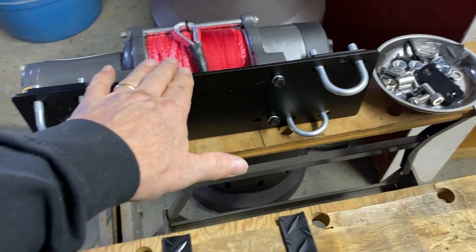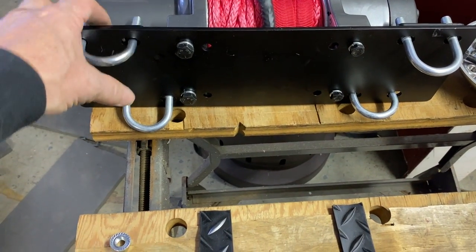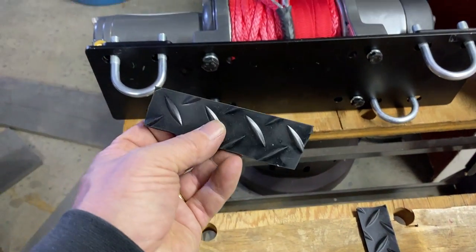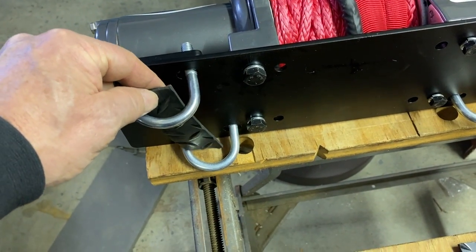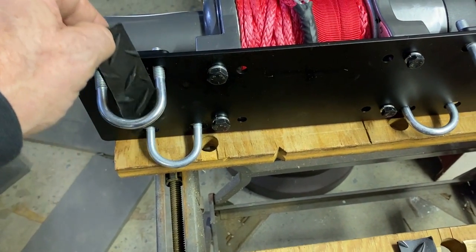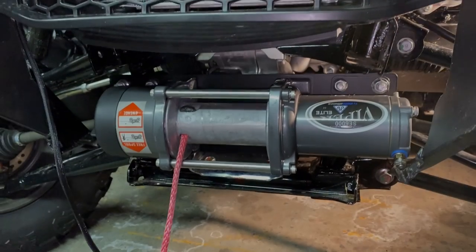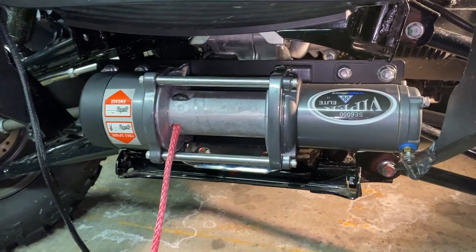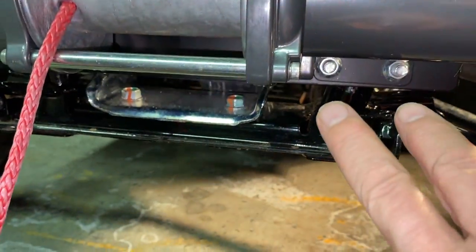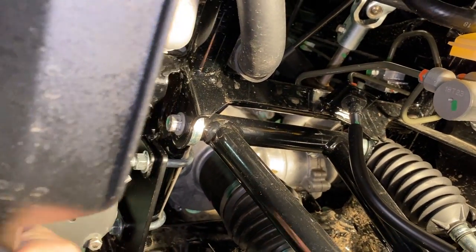Our plan when mounting this winch mounting bracket — which is now fully mounted to the winch itself — with these U-bolts, the mounting bar is going through the machine. We're going to have a couple of pieces of rubber mat stripping cut out and placed right behind there, which will keep the U-bolts from going directly against the metal bar, keep it from moving around, and avoid metal-against-metal scratching. Here you can see the winch mounted to our machine. The orientation is upside down as you can see by the label — that's on purpose, part of the instructions. There are two nuts here and two on the bottom, same thing on the other side, holding these U-bolts. There's our little rubber piece to protect the frame.